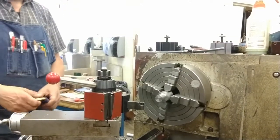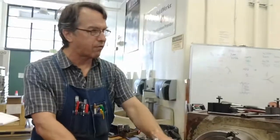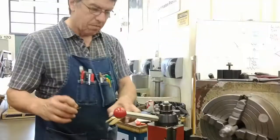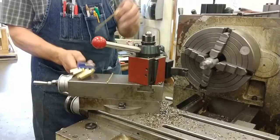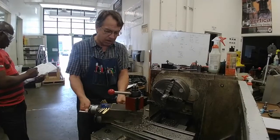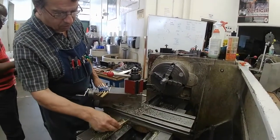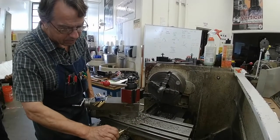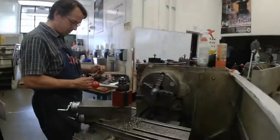Okay. I also want to, especially on these lighter machines like the Acras, you're not even going to try this part on the LeBlanc. The LeBlancs aren't rigid enough for this radius. They'll do everything else just fine. But I'm going to lock up my compound and my cross slide. The compound I'll lock tightly, tight pressing the screw against it. I need rigidity here. And with the cross slide, I'm locking it lightly, so there's some drag on the cross slide. Okay? Don't forget to loosen those when you're done.